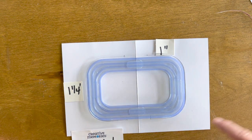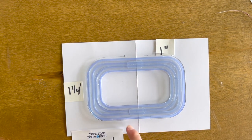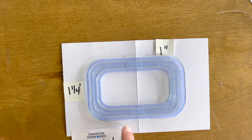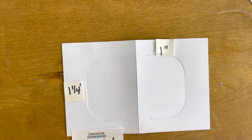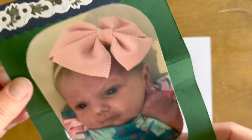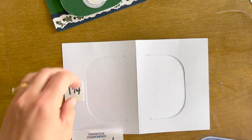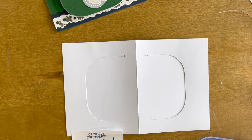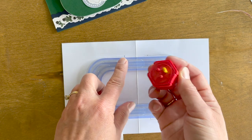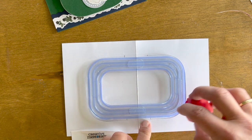Then you will score and cut just the U-shaped portion, and you will lift your blade at three and a half inches from each side. So this measures three and a half inches here, and going in three and a half inches from the other side. I've already done the measurements — scored it, cut it, put the two pegs right into the groove of the template, cut, lifted, went back down, and cut again.